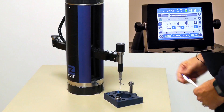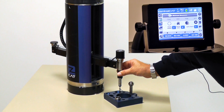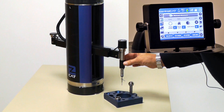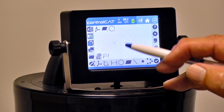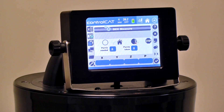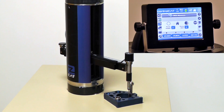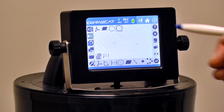I'm going to go above this large diameter and give it a go-to. I only have to take three points, because it knows it's going to measure six. I'm going to measure the first point, then the second point will be not quite halfway around the circle, and the third point will be before the finish of the circle. I'll raise it up again, give it another go-to, and hit Finish. It's flashing — I'll put it on my session. You'll notice it says diameter number two. To run it under DCC, I'll highlight it, hit Enter, and now it will go down and take six points around the diameter of that circle, vector perfectly, and then go to my go-to.